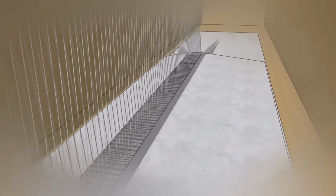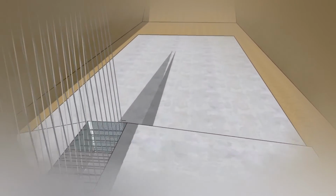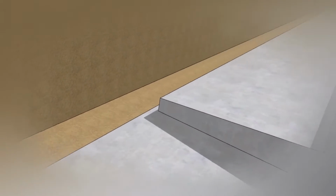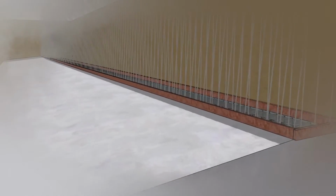So this is how it looks after the footing was done for the retaining wall. Once retaining wall footing is done, retaining wall concreting is started in 4 lifts because the height of the retaining wall is 6.8 meters.